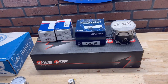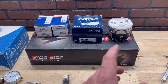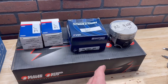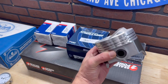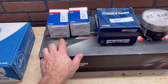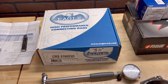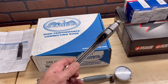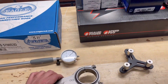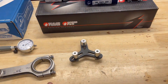Real quick — what's going to get poked in this engine for pistons and rods and bearings and all that fun jazz? I'm running a forged Sealed Power Speed Pro piston, meant for high compression. I'm going to have some small chamber heads. I'm running some Hastings piston rings, some Clevite performance bearings that have an extra thousandths clearance built into them, and a nice set of Eagle forged H-beam connecting rods. That's the parts we're working with.